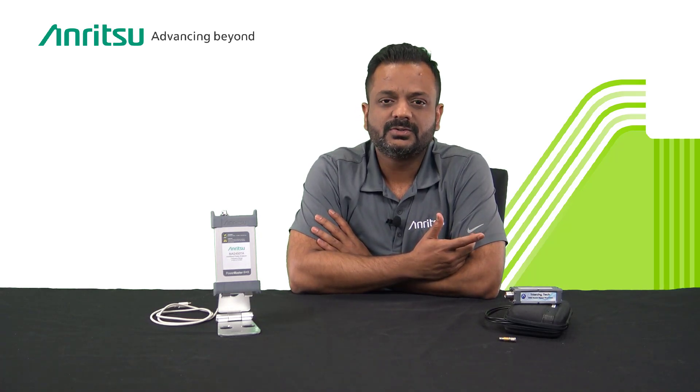Testing over the air makes it prone to interference or crosstalk. The solution is PowerMaster, which provides two solutions: channel monitor mode and power hunter mode. The channel monitor mode allows the user to select up to six frequency channels, up to 20 megahertz wide, and monitor their CW amplitude or channel power simultaneously.